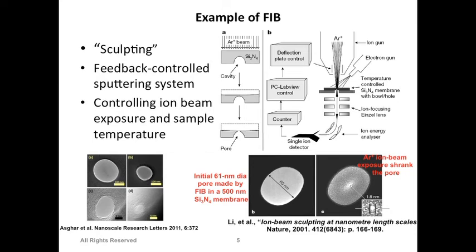This is a very common way to shrink pores; people also use electron beam to shrink a pore by providing energy. Now, we're using argon ions to drill the pore, but there's also an electron gun shown here. Can anyone explain why we need the electron gun there, when we just want to use the argon ions to drill?